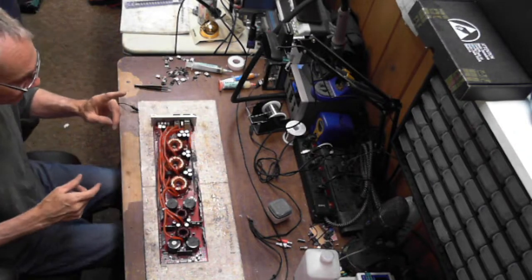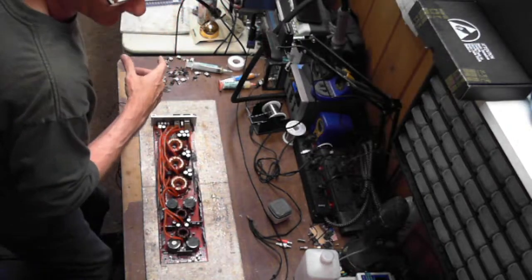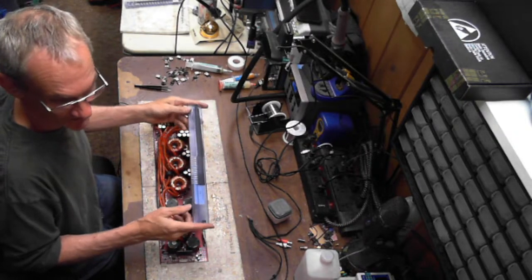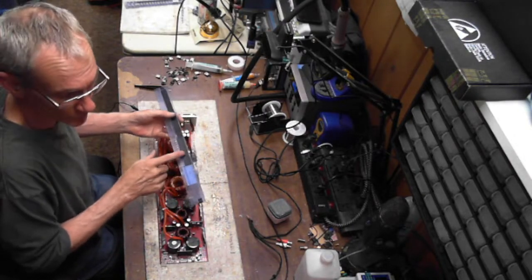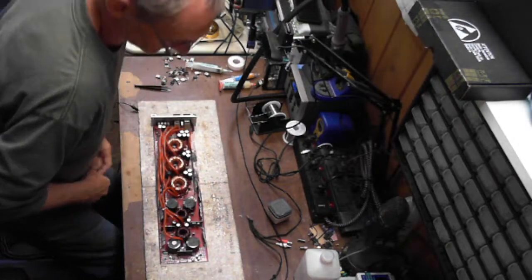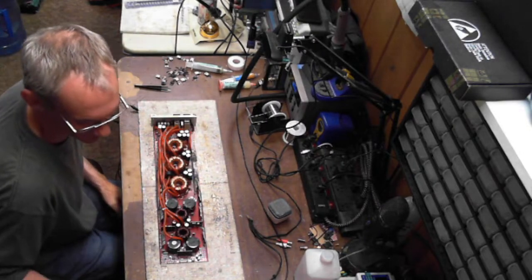Now, if you are ordering something that is in really short supply, like these IRFP 4868s, there's been a few times where I'll get like 4 of one date and 4 of another date, or 3 and 1. It's the really hard to find transistors that you're probably going to see some discrepancy in matched pairs.